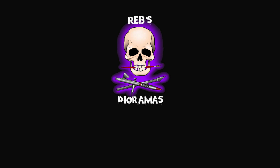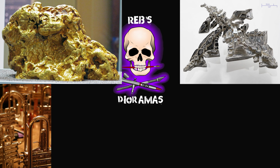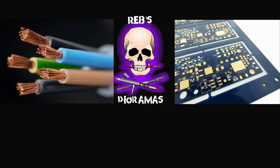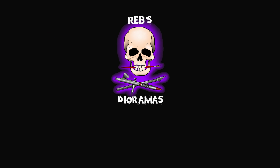As I said, there's other types of soldering, but for electronics they don't apply to us because of the temperature range. Electronic soldering is mostly done up to 450 degrees Celsius. Anything over 450 degrees Celsius is usually called silver soldering or hard soldering. This is most commonly used when you need to join semi-precious metals together such as gold, silver, brass and copper. Although for electronics, while we do solder to copper and gold, we aren't doing silver soldering because of the type of solder we use, which is normally tin lead or tin copper, but the copper content isn't high enough for us to need more than 450 degrees Celsius to solder correctly.